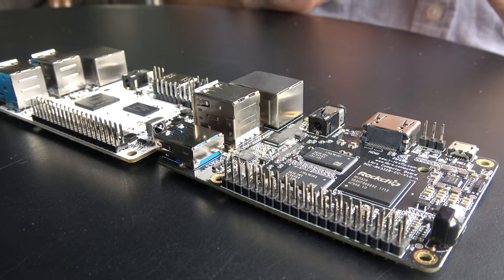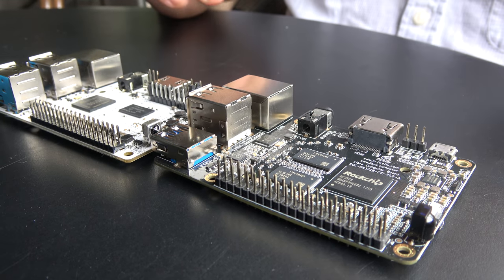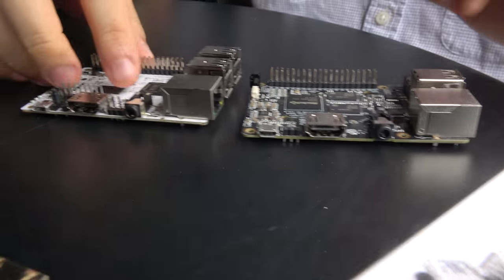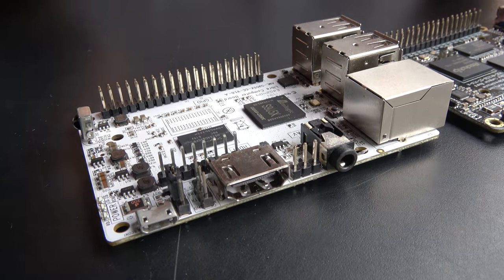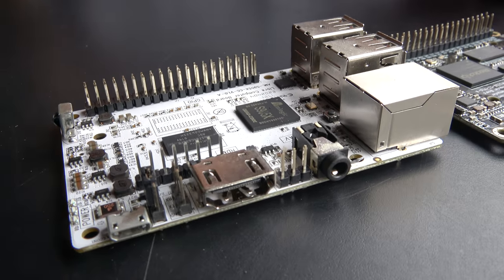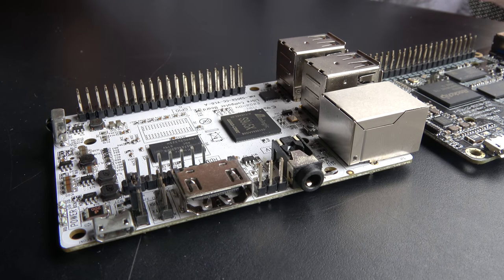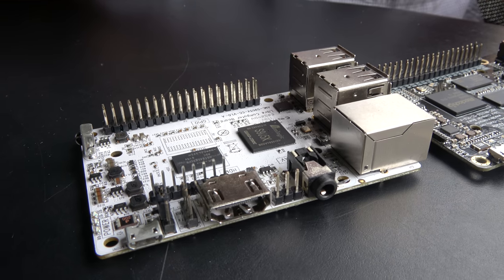Products like cases, various hats, storage devices, and audio devices work on this form factor. This board is especially low power because the S905X chip is used by a lot of TV boxes in Shenzhen, built for ultra-low cost with very efficient power supplies. At idle with no video, this uses less than about 130mA at 5V — extremely low for a quad-core A53. You can use a 1A power bank.